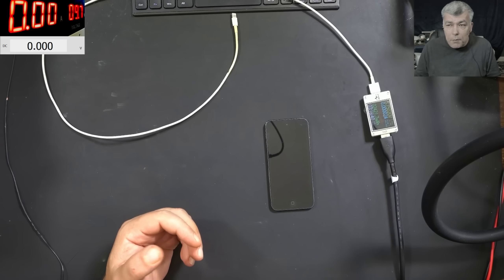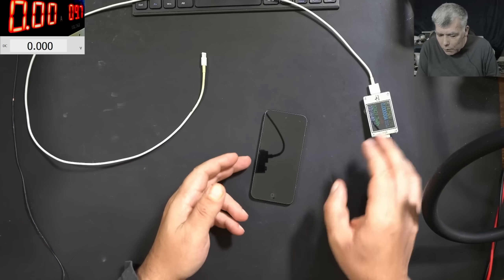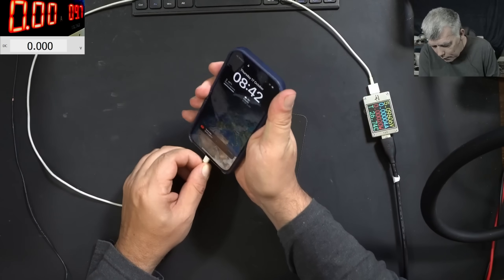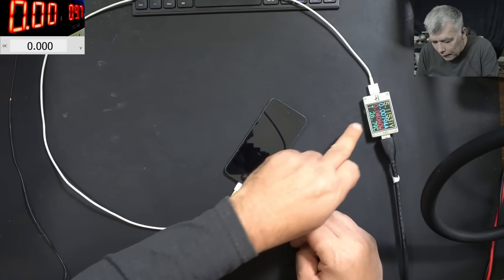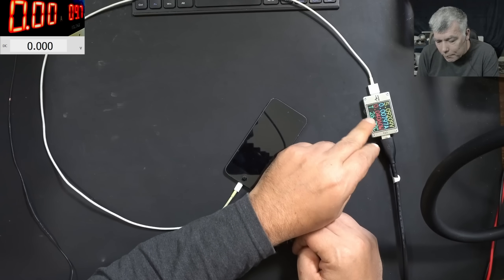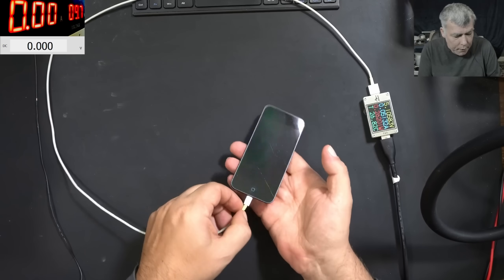So we can spend about one and a half hours trying to fix this iPod — if we can't fix it in that time, we charge nothing. We have a power meter here. Testing it on my phone, you can see the charging sign, so the power meter and cable are okay. Plugging into the iPod, you can see the current is going slightly up with a jumping current. Jumping current means there is something short on the motherboard, taking nearly no current, but even that small amount is jumping.